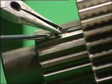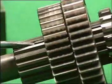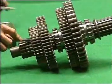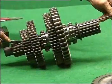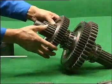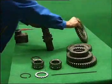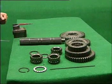Clamp and take out the three times ten spring cylinder pin manually. Draw out the hex key of the main shaft. Rotate the main shaft and remove the gears in turn, then take out the sliding sleeve. Clean the parts after dismantlement and check every part.